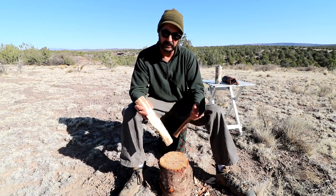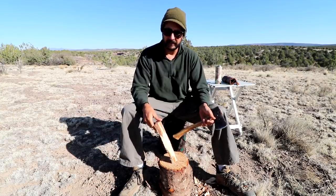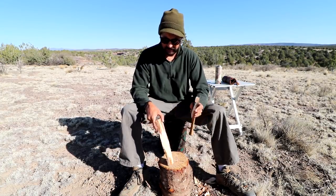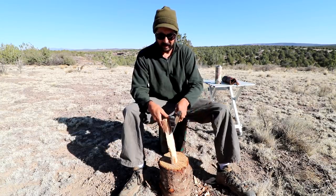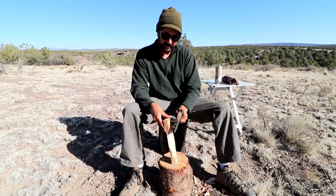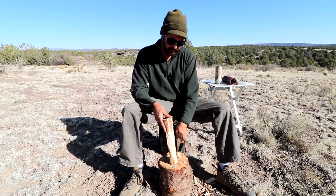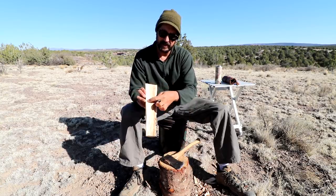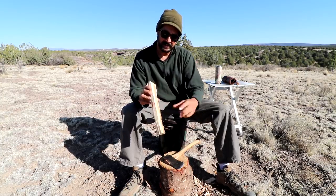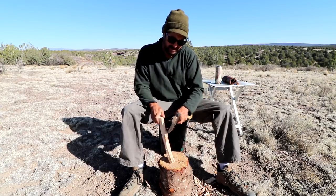With wood carving you're using sharp tools — there is an inherent danger, but it's all about developing a skill set and learning to work with your tools. There are a lot of techniques that aren't very evident from the start. It may look like I'm haphazardly swinging away, but I'm using very focused short strokes, adjusting the angle of the axe head a lot, and generally keeping a very shallow cut — not going really deep into the wood. At this point I'm starting to visualize the bowl of the spoon and the narrow handle. I use a feathering technique — I'm sure there's a technical name for it — to start chipping away and shaping.